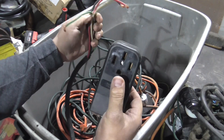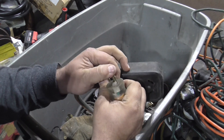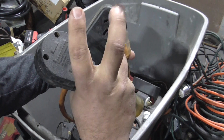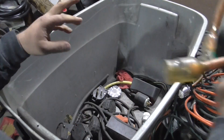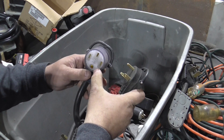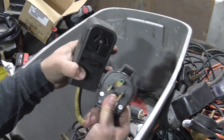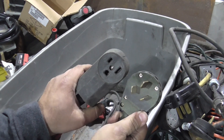From there I can adapt with all these cords to whatever welding machine I have. This one is for dual voltage machines where I can plug into 110 and it goes onto a 220 plug — so it goes from 110 to 220, or back to 110. This one goes from a 30 amp air compressor outlet to my style welder. This RV-style adapter goes from a 30 amp single-phase outlet to a 220 outlet — still single-phase, only one hot leg used. This one goes from the Miller style outlet to my style, and this one goes the other direction — from my style to the Miller style outlet.